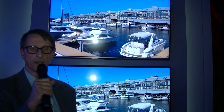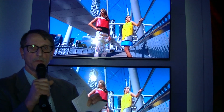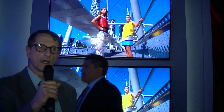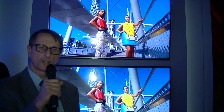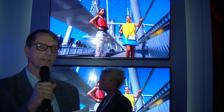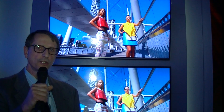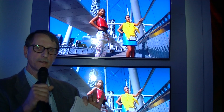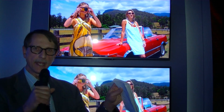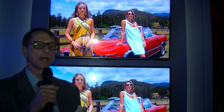The Quatron technology they developed several years ago uses RGB yellow subpixels, and the Revelation part is now the addition of two aspects to that. It's essentially subpixel rendering, done in two different aspects. One is that physically they've divided each RGB yellow pixel in half, so there are two subpixels for each pixel that was previously available, and each of those subpixels is independently addressable.